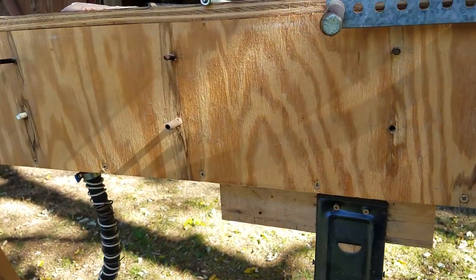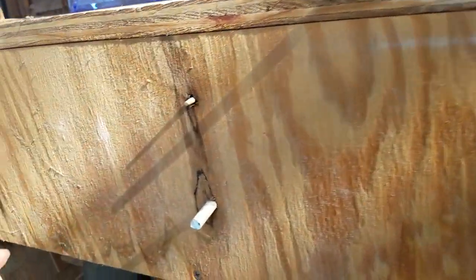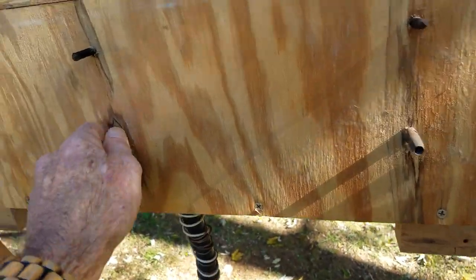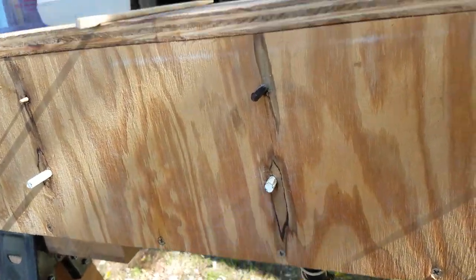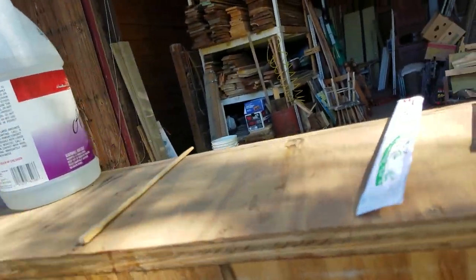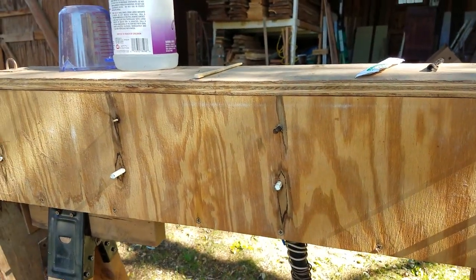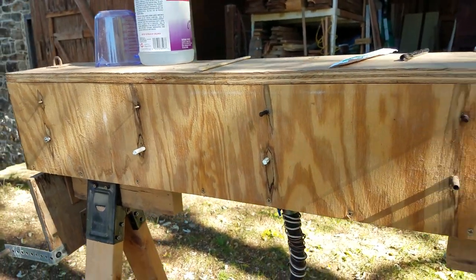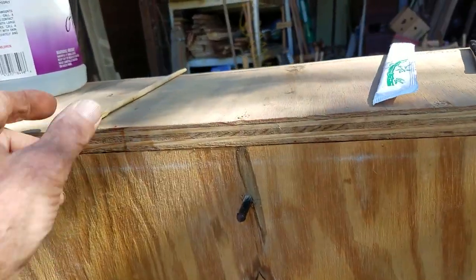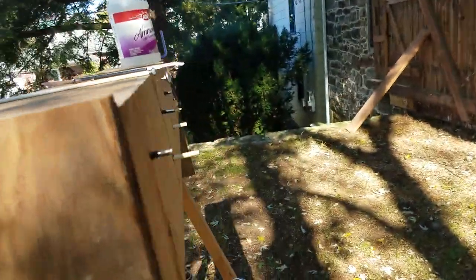I have used supports ranging from plastic coated steel rails to fiberglass rods — which happened to be old arrows — and also some chopsticks. The last time I steamed, I steamed red oak for the first time. I had steel rods in here and that steel reacted with the tannins in the wood and left horrible black stains on the parts. So I took them out and, fishing around, I found I had chopsticks. They were exactly the right length and fit in just right.